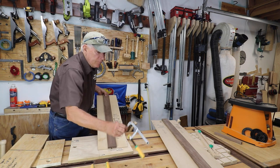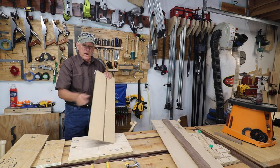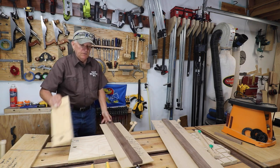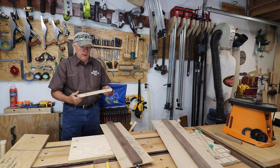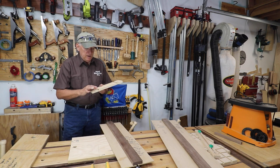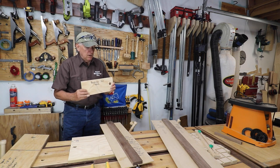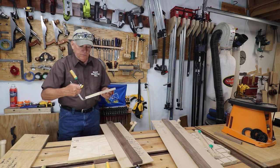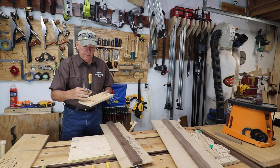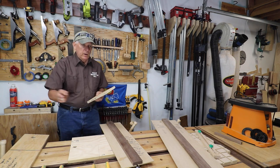I had difficulty sliding the clamps. When I switched to a single cut — going one time through the workpiece with the dovetail bit on my larger, more powerful router — things came out beautifully and everything slides nicely. Occasionally you need a little trimming with a chisel or some filing where clamps get hung up, but generally it comes out very well. I recommend having a big router for this.